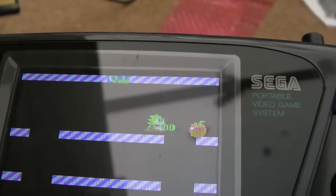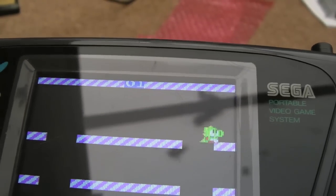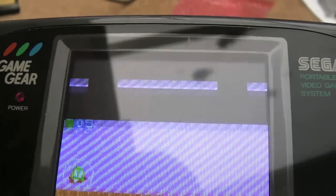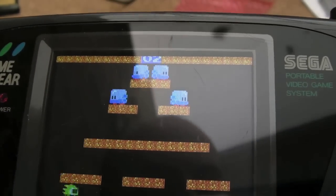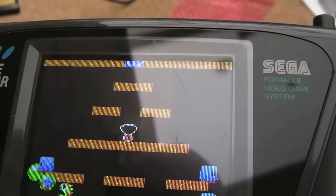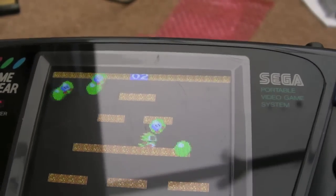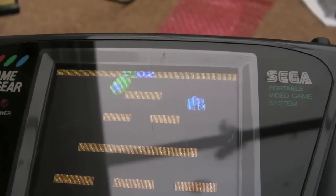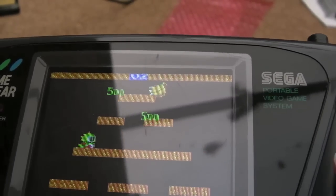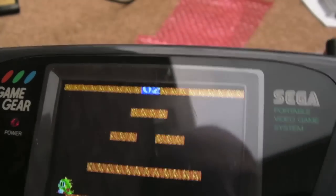It's not just the electronic side of it, what he's managed to implement here technically. It's the engineering side of it as well. He's done such a good job of getting it all to fit. Like I said, my only negative thing, maybe I just need to adjust this down a little bit. I'd rather lose a pixel or two at the bottom of the screen to gain one or two from the top. I haven't soldered all four corners of the LCD yet, so I've got the ability to move that around. I would recommend that you do a similar thing. Do the four solder tabs last.